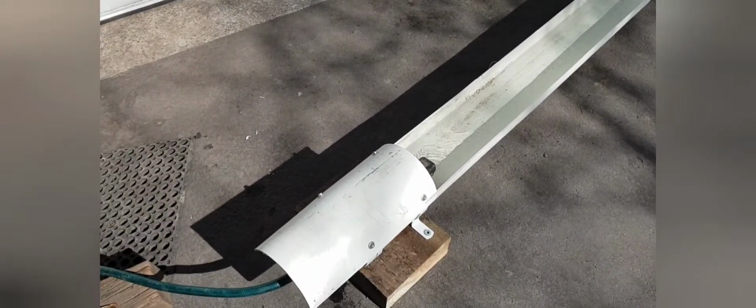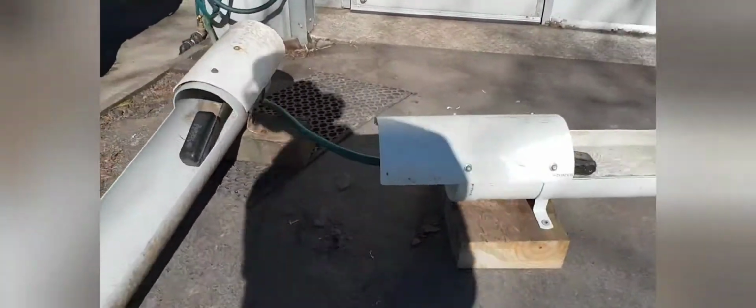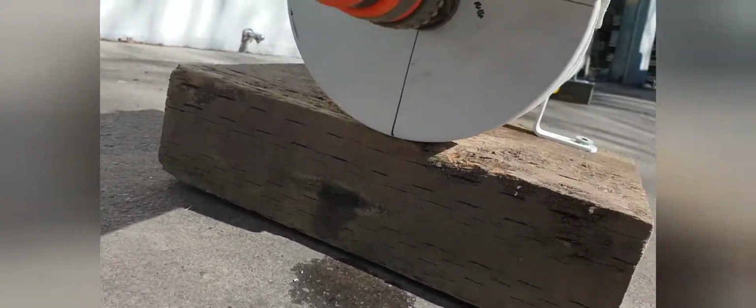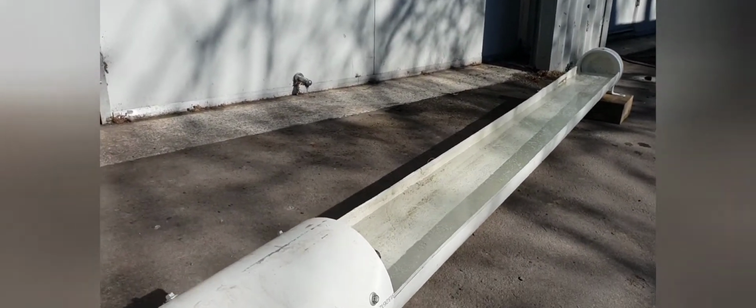So that's really important. Now it's filling up with water, and obviously I've got to make sure that it's not level, but we want to just check that there's no drips at the back. Oh, see, there's a drip there. So there's a drip happening just under here, so we're going to take that off, and we're going to put a bit more Teflon tape on there to try and take care of the drip that's coming. We've got to get rid of that drip. We don't want that when it's out in the paddock. And then that's about right there.